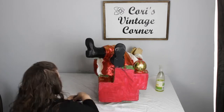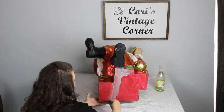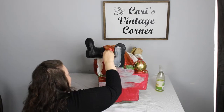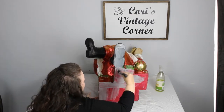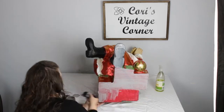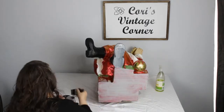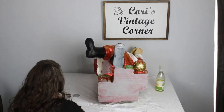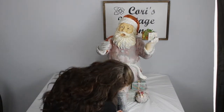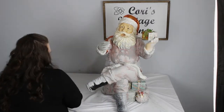I just started out with Gravel Road — just wanted to do a simple base coat. Don't have to have full coverage on there. The whole purpose of this is just to cut back on some of the shine and to give it a coat that'll make it easier to do the faux concrete finish on it. Some of the places were a little more difficult to get to, but I just switched out the brushes in order to get to those hard-to-reach places.